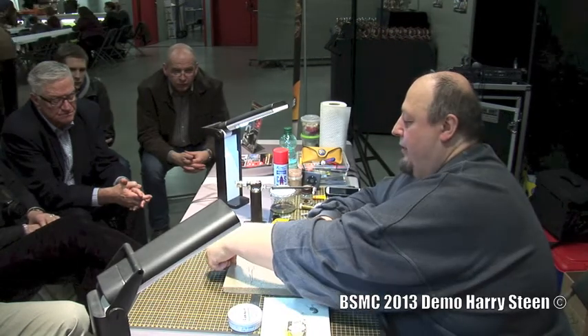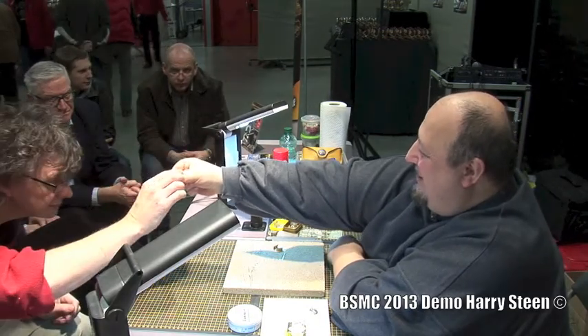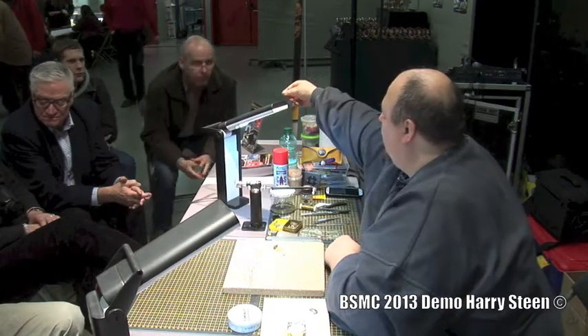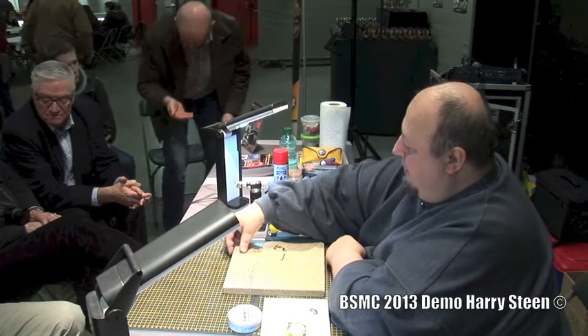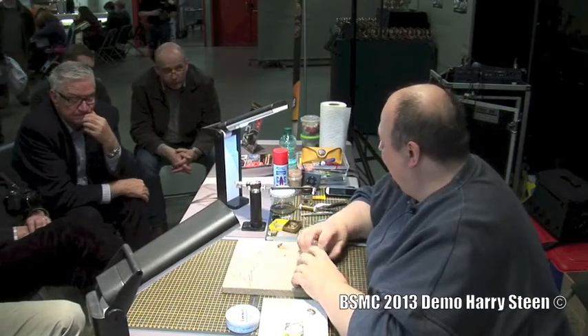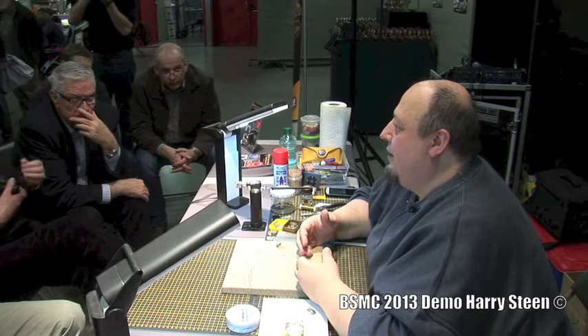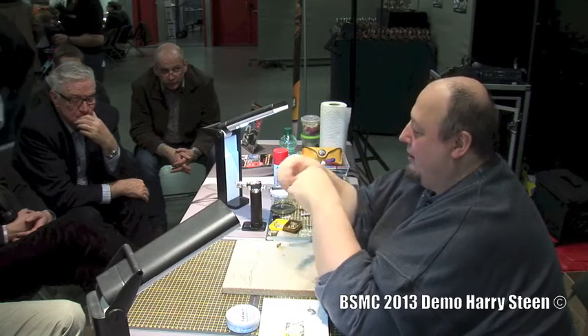But there's another reason to solder. Can you glue something like this? One last thing to talk about before we get you all soldering: soldering is not like super gluing. If you have a gap with super glue you can smear a little more on it and sand it down or take some Tamiya putty. Soldering does only work if the parts actually touch — you can have a small gap, but you cannot cross a large gap.